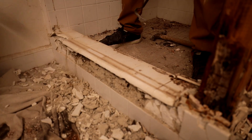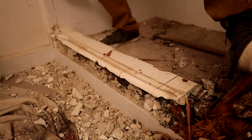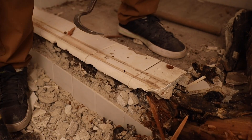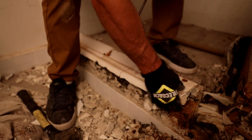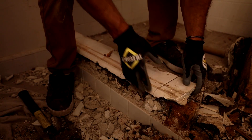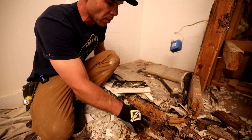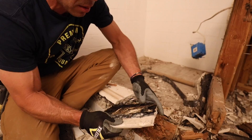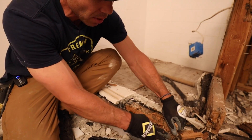Kind of musky. Wood is all rotten right here. Let's see what's under this curb top here if I can get it off. The curb is obviously rotten. We have a mortar bed install, chicken wire, mortar, and a hot mop — and the wood is dry rotted.